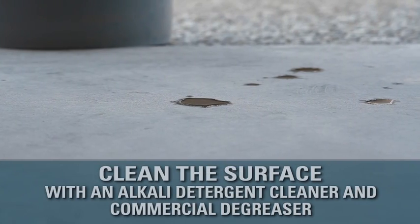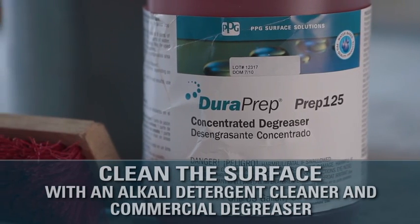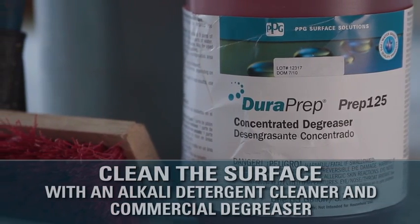No, you actually have to concern yourself with oil contamination, previously applied sealers, or additives that may have been added to the concrete. If the concrete is contaminated with oil or grease, the first step is to clean the surface with an alkali detergent cleaner and commercial degreaser, such as DuraPrep 125. For optimal results, use the detergent in combination with a steam cleaner, but you can also do it manually.